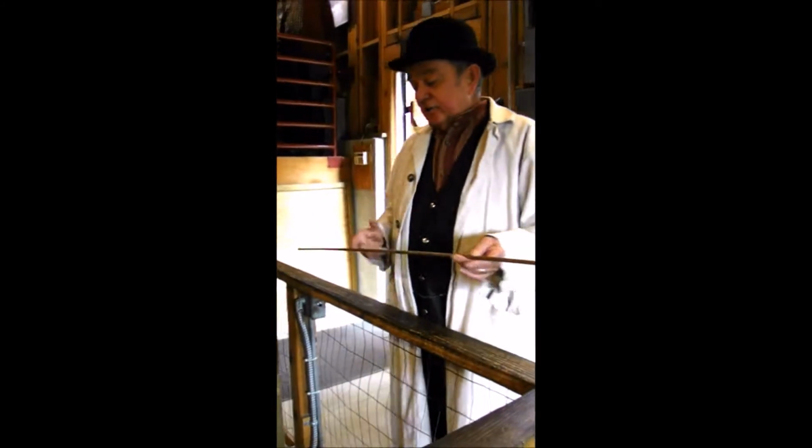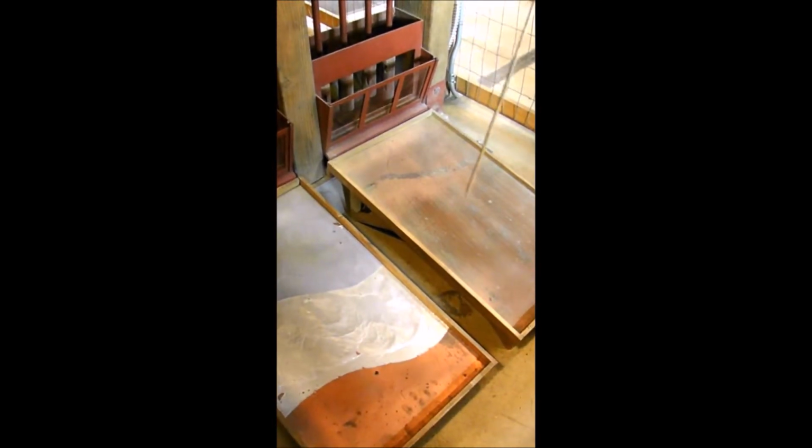So the ore was crushed and water was added to it, and the slurry ran out these filters and ran over the amalgamation tables. Those tables are slightly sloped so that the slurry would run right down the tables. The top of the table was copper, and onto the copper they would spread a liquid metal, mercury. Mercury sticks to copper like paint sticking onto a wall, but it does not dry out. The copper holds it in place on that sloped surface, so that when the machine's turned on and the slurry starts running over that mercury, the mercury goes to work grabbing every little speck of gold that's in there.